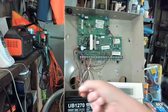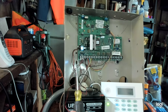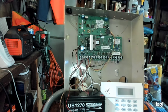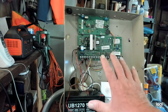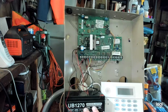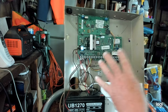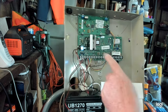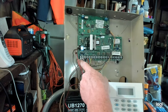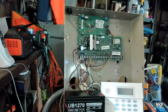The first thing you want to do is disconnect the battery. I've already taken the positive off — just one side is fine. Then go all the way to the left and disconnect terminal one — whatever's under terminal one, disconnect it. This will work with a lot of panels. On the Vista series Ademco panels, it's terminal one — just take one leg off and that's it.